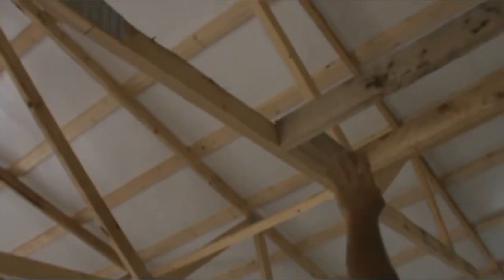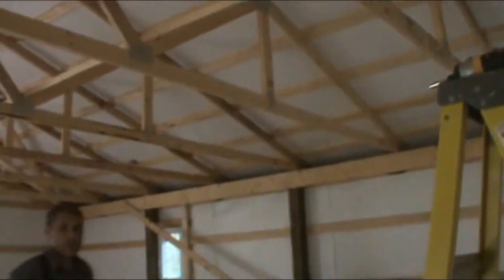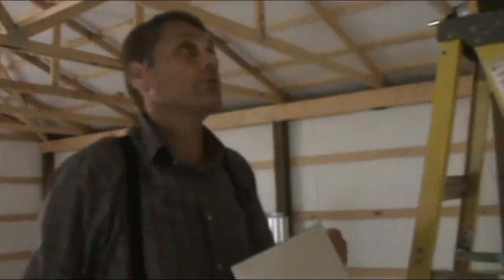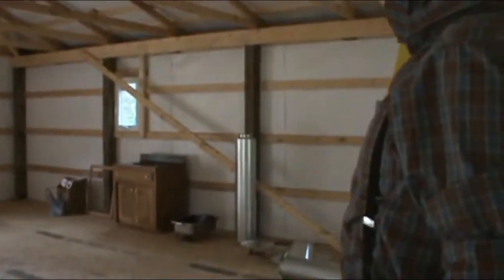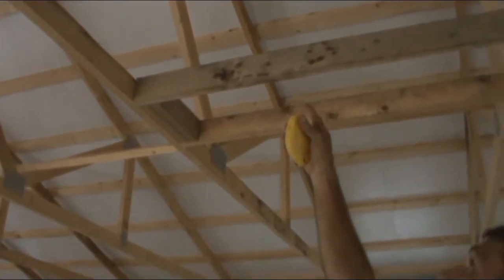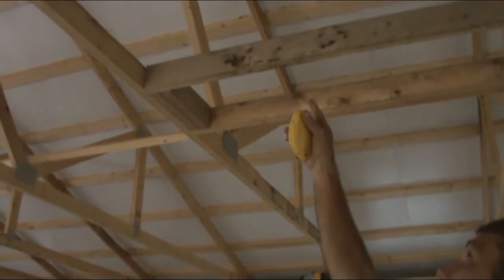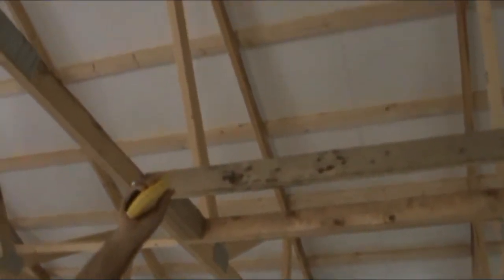And so we framed out, or I should say we are framing out, our box that will hold the chimney stack. And so we had lined it up, as you can see the chalk lines up here, perhaps you can. The back of this chimney pipe would be there to make sure that we are in the middle of those two ridges with our boot.